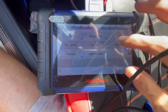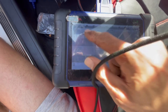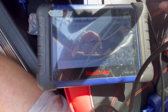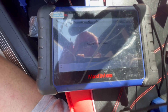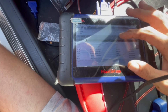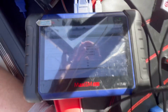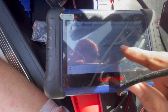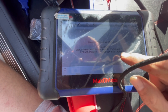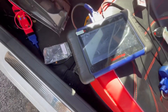We're going to Mercedes Expert, selection, go to EIS, read EIS data, OBD on vehicle, auto scan W207, reading the EIS. After we did the read EIS we're gonna press OK, save the EIS file — ending in 455, which is the VIN.